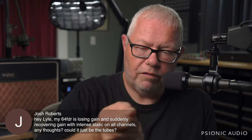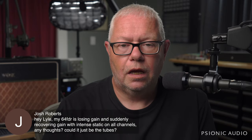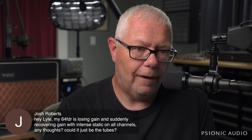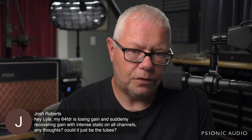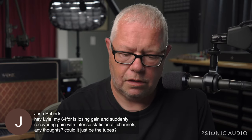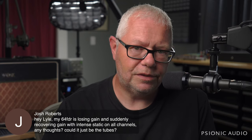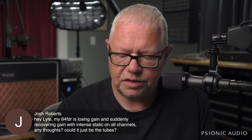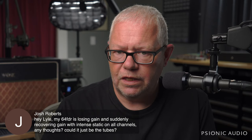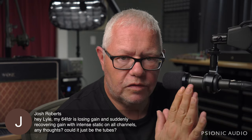Then you hit a certain note, and it vibrates loose. Those are very common. It could also just be dirty tube sockets. It's probably something relatively minor, even if it's a filter cap. Filter caps are easy to change on those old Fenders. Leo's genius is not just that he made an amp that was good as he sold it to you, but it was designed to be easy to service. And for those of you out there who want to keep all original everything in a Fender, it was designed to be easily serviced because Leo expected you to service it.